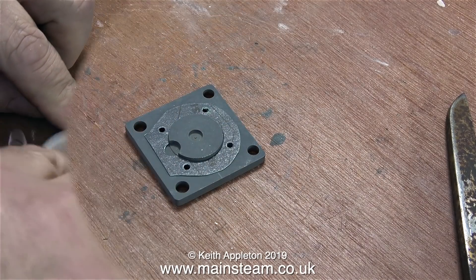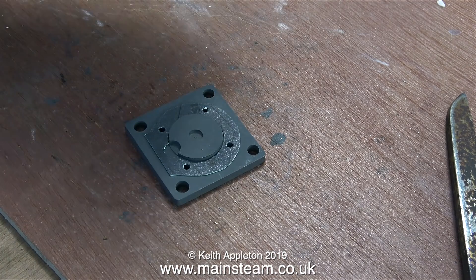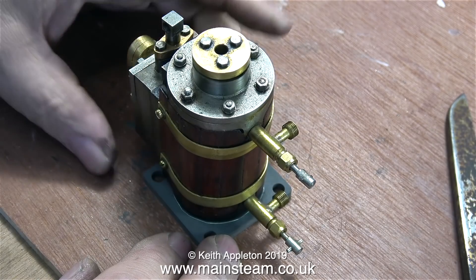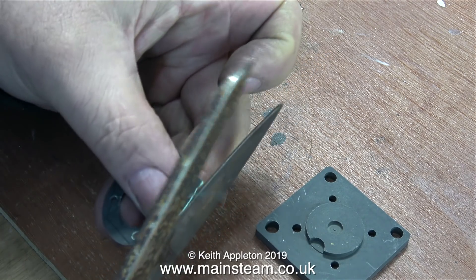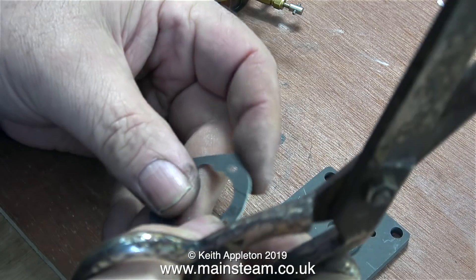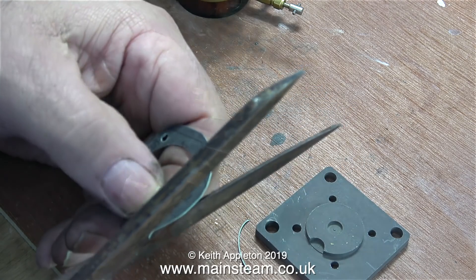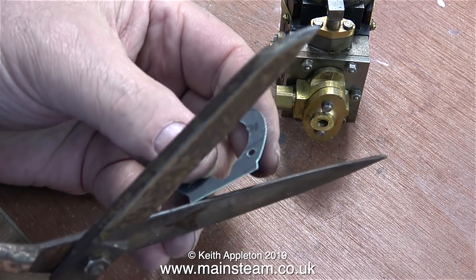Now the gasket is complete and I'm wiping off the ink — simple and logical, but quite easy to forget. I've also cut around the steam inlet port, though I didn't need to; it would have worked perfectly well with the gasket in one piece. When I sit the cylinder on top of the bed plate you can see it's quite a good fit, without any gasket sticking out beyond the cylinder. I think I can get it slightly better though, so I'm undercutting it slightly more, particularly on the straight part, and getting the shape right where it transitions from round to square. I'm being a bit picky because the large upright cylinder on a beam engine is very much the focal point — everyone would notice if the gasket's too big and sticking out. Once it's got oil on it, it will soak into the gasket and become invisible; the white line will disappear.